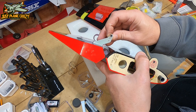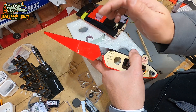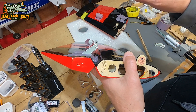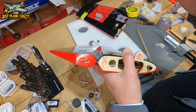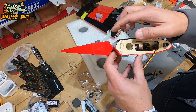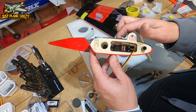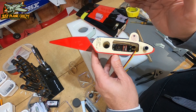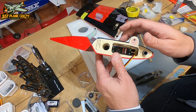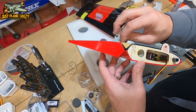Because your horns can vary, you want your horns to be perfect on this hinge line. On most models we don't pay a lot of attention to this, but this one can go from being right on to being really far off. The whole goal is to make this side as perfectly symmetrical as I can to that side — servos in the right spots, arms at the right spots, linkage at the right spots, all linkages the same. Where it starts is getting these pivot points exactly on center line. Then my linkage is the same, then I'll program center, then program endpoints and make them match for the deflection on these elevator halves. We'll do the mechanical stuff, then programming last, and we should have very little to set up in the radio.